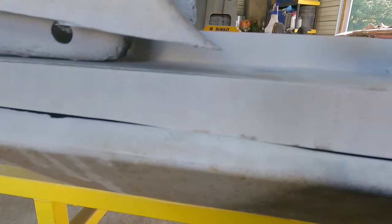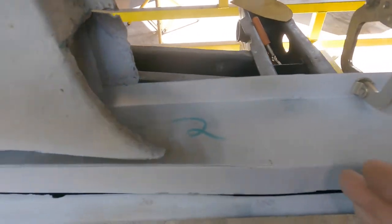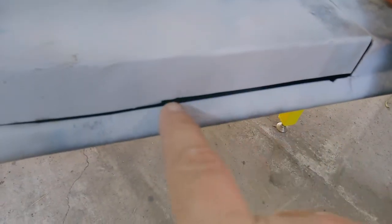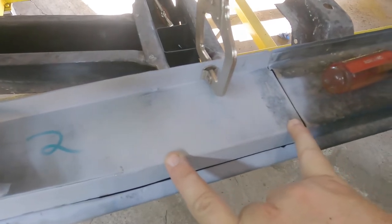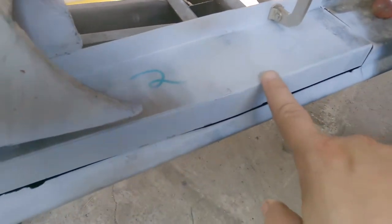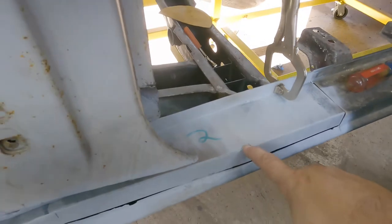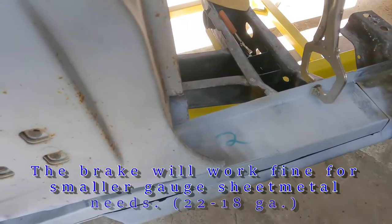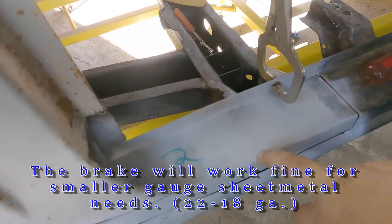This panel was made out of three pieces. It would have been easier in two, but I was limited by my equipment. My initial vision was to create this back piece right here, since the dimensions remain the same. That turned out really well — it gave my little Harbor Freight brake press a bit of a fit, but it worked. When I attempted the longer piece, the press just wasn't having it. That's the limitation of a 90-degree press from Harbor Freight — 16-gauge steel isn't going to work.